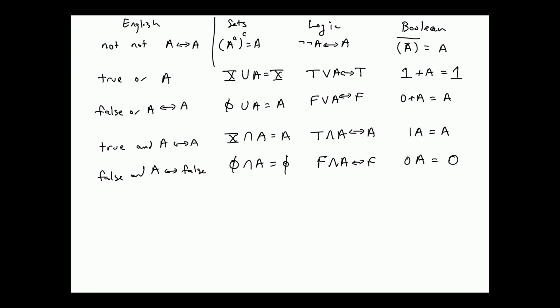Now, in terms of the circuits, does this have anything to do with the circuits at first glance? No, but does it? Yes. Because if I make an AND gate and I have one input that's always on, the output purely depends on the other input. Well, that's exactly what we said here, just in a notation sense. So all of these are equivalent to different situations with circuits. And that's why I'm talking about this, so that if we develop these tools, we can then use them to help us with more complicated circuits than we've done so far. Does that make sense? That's the crazy plot that I'm up to here. I'm not just doing this because I like math, there's an ulterior motive.